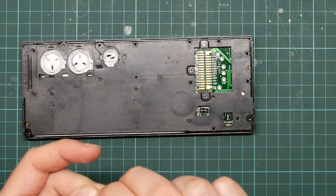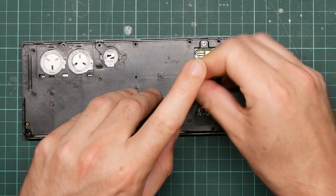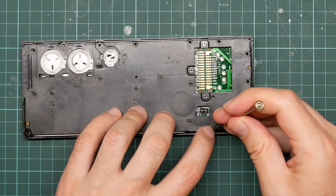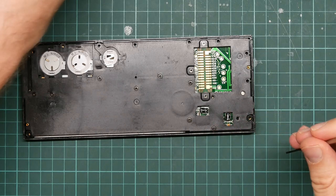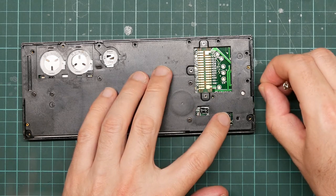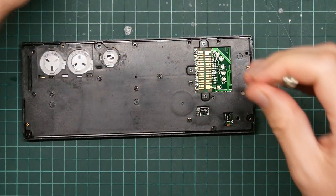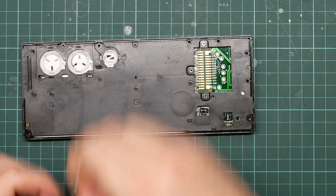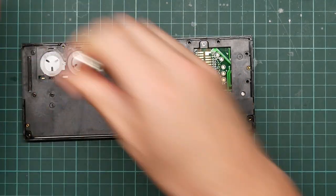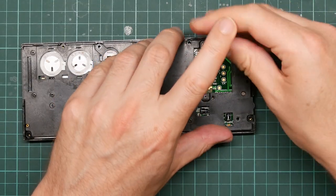If I see the address counting up in small increments of 1 or 2 bytes, that will be fetching opcodes from the ROM, and I can probably rely on the data lines showing me the byte being read from ROM. The other thing I need to hook up to is the chip select lines, because with luck, when reading from the ROM, it will not be asserting any of the chip select lines, because the chip select lines will be there to access RAM. That way I'll be able to easily distinguish between ROM and RAM.